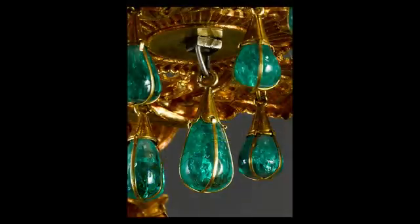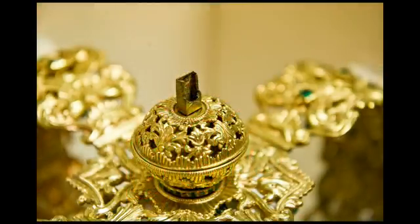Luckily, the crown provided its own simple solution. This large main emerald in the middle section of the crown's interior was attached to a loop that was soldered onto a handmade modern nut. This nut was screwed onto a handmade silver threaded rod that passed through the golden ball and had been soldered to the bottom of a small modern mount. And this mount held the cross.